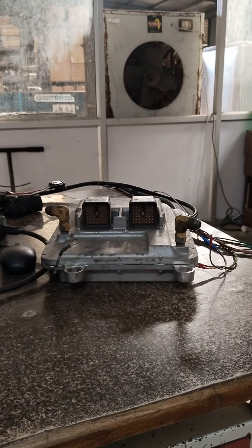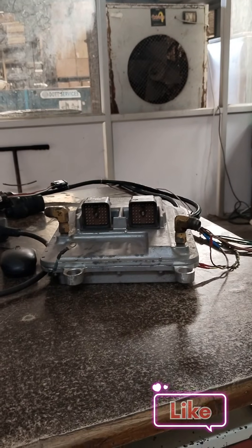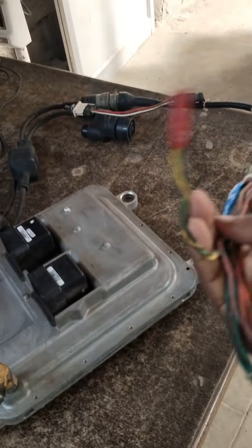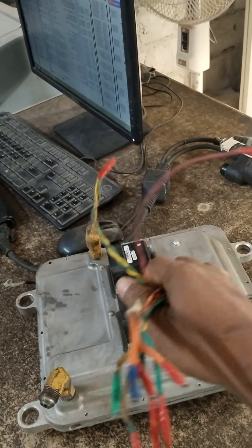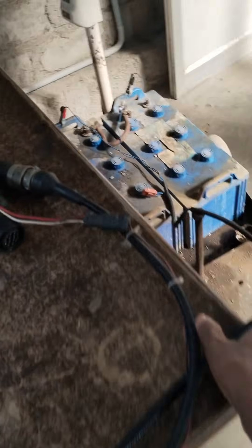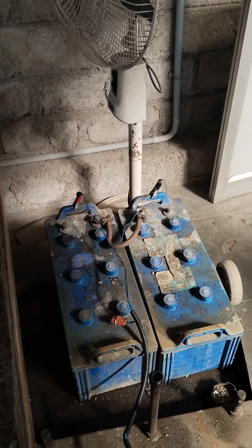Welcome back to the Diesel Under channel. Today we will learn about Caterpillar ECMs — how to power up on the test bench. For that we require an external harness to power up the ECM, so we will make this harness for different ECMs to power up and to check the ECMs as well. We check the engines before mounting on the machinery after repairs.